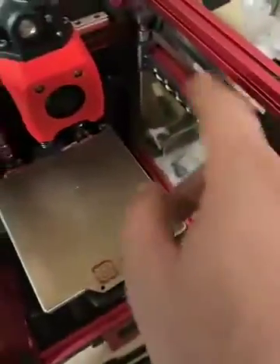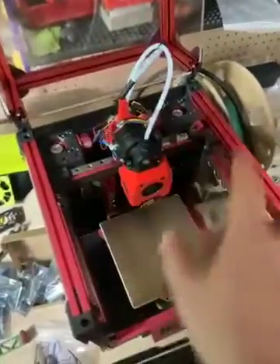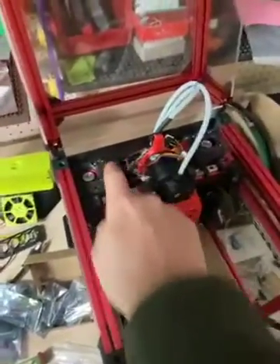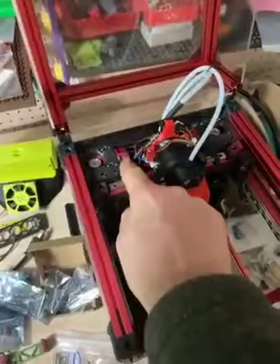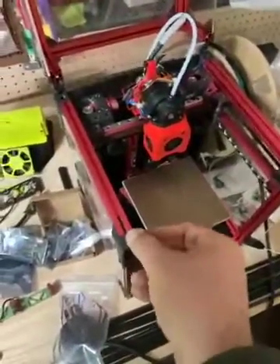Once you get them set, lock it down. Take the tool head, spin it around. Make sure you're not riding up on anything — everything's centered. Then check the tension again, because once we've moved this tool head, we've distributed the tension, so anything loose is going to show up. So you're going to have to do it again. Unscrew the bolts, whatever — half turn — however you're judging equal on both sides. I use the nubs, maybe the middle of the nub. Do the same thing. Check that your screws here that hold the front idlers in are secured; they can sometimes work loose.